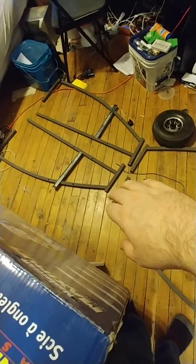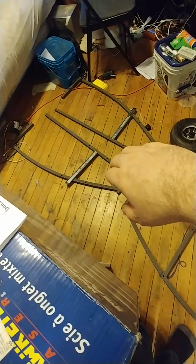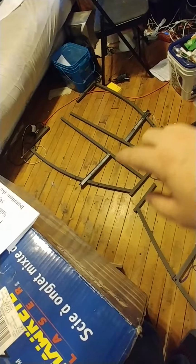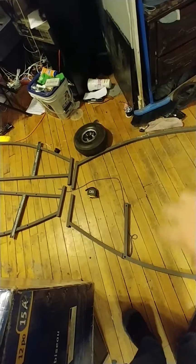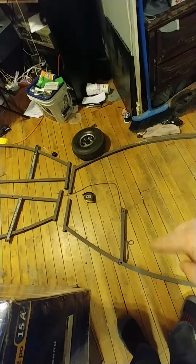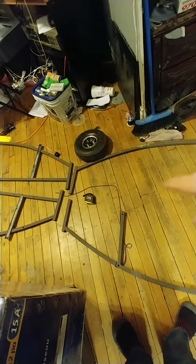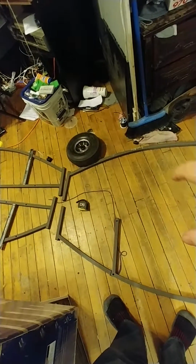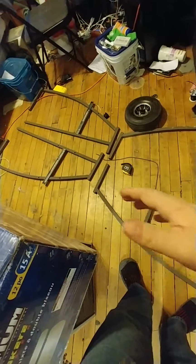And then 6 inches back, I'll be building a brace, building a framing for the firewall, and then 15 inches to the front. From this point on, 15 inches, I'll cut that off. The excess will go to the back. I'll be building a square or rectangle frame across here for the grill. And then I'll probably do some reinforcements on here, so when I build the actual brush guard, I have something to bolt it to. And it's going to be like a 3D skeleton coming up.